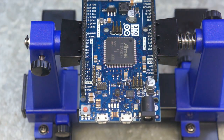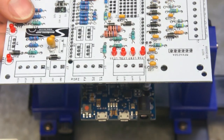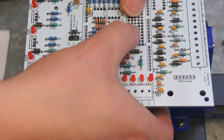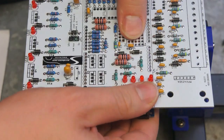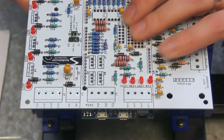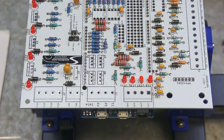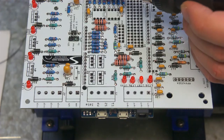The tricky part is we then take our board, lay it over the top of the pins, and push them through the holes. This can be a little bit fiddly to try and get them all aligning and popping through the holes. You do need to give it a little bit of a wobble sometimes. Occasionally you'll have one or more slightly bent pins. That will hold itself in place and we can then go around all of these pins and solder them in.